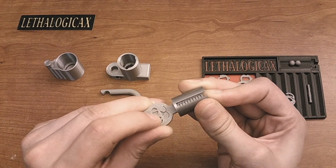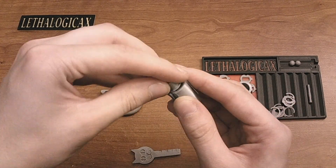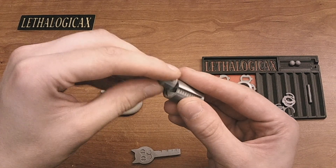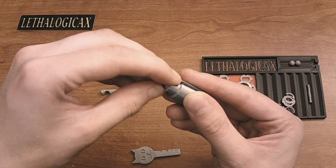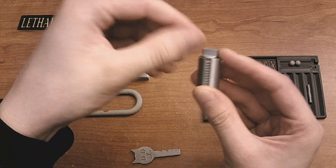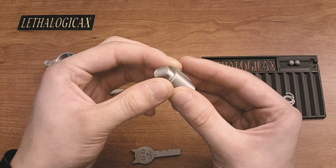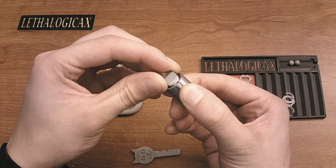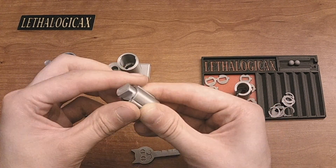After that, you should eventually get all of the gates lined up when you turn the key. You can put the cap on the back of the core. There is a little cutout in this core which indexes with the sidebar. Once the sidebar is in place, you'll note that the actuator cap no longer turns.